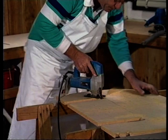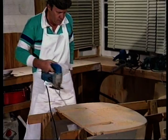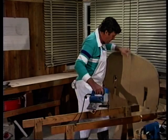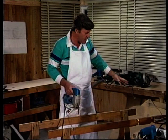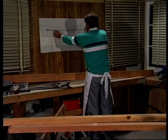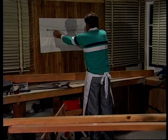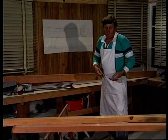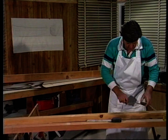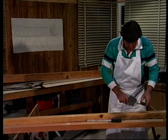Now I've gotten all of the formers and all of their slots for the strongback cut as accurately as I possibly can. The next step is to cut the Oregon for the strongback to length. I've chosen the straightest timber I can find — it's Oregon and it really is true and straight. Off the drawing I've measured my 20 inches of the major section of the strongback, which of course translates to 80 inches. That doesn't necessarily have to be absolutely accurate, so you don't have to go to the trouble of using dividers for that. The next most important step: put your protective goggles on.